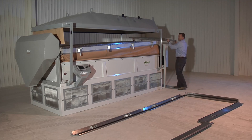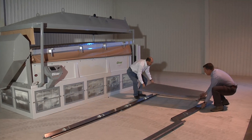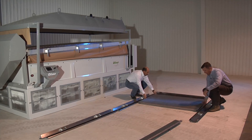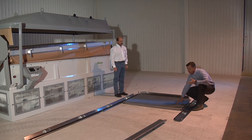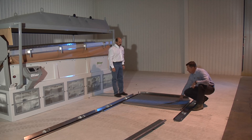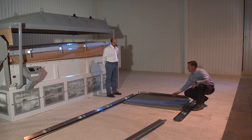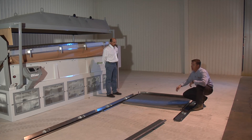These pieces are the heart of the modular deck and are replaceable one piece at a time. So if you're changing out the over cover on this deck between two different crops — as mentioned, soybean and wheat needing different meshes — it's very easy to do. Also, most operators realize that over the years the section being fed to takes more wear than the sections below it, so this section would be changeable without having to change out the rest.